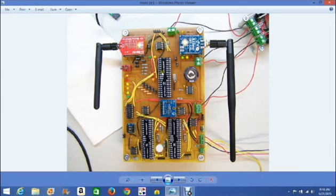This processor here is the central, or I guess I would call it administrative, processor for the board. It communicates with the other 2, pulling information from them, and uploads that weather data to a website. It also communicates back and forth through this radio frequency module, which is used to communicate with another weather station that has the same board. The remote weather station that this board would talk to would not have the Wi-Fi module. The remote weather station would only have this RF module.